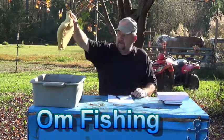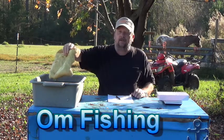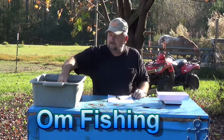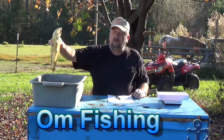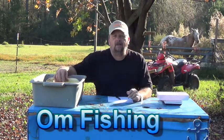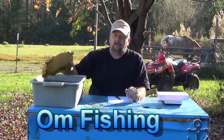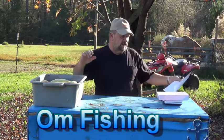As you can see, it's got some water. It hasn't had the chance to let any of it evaporate because it's been pushed under the water. But it still floats, though it holds a lot of water. The buoyancy foam I took out of the boat on the Rabala boat project, which is a 1978, was totally saturated. It was very heavy. This foam isn't nowhere near like that. It still floats and it's not as heavy as that foam was.